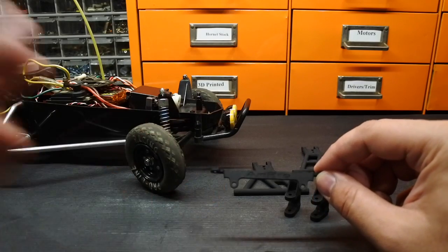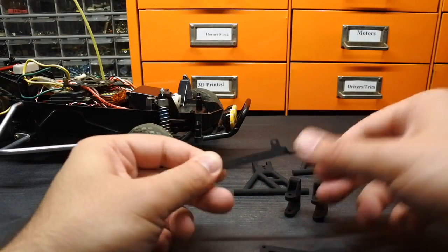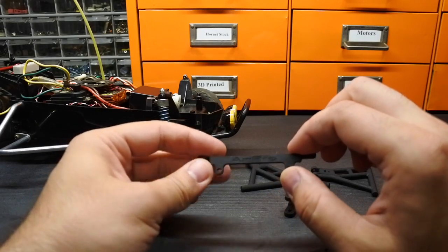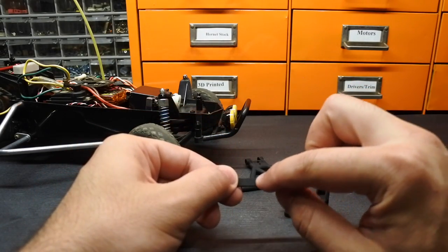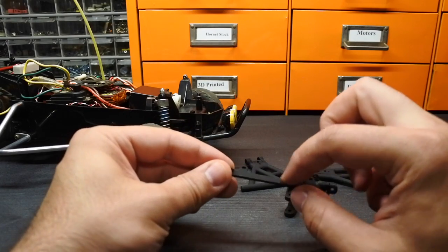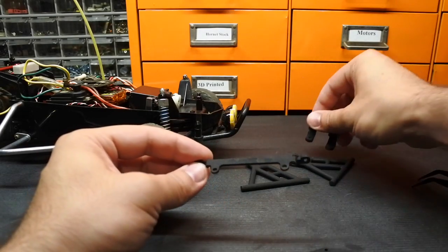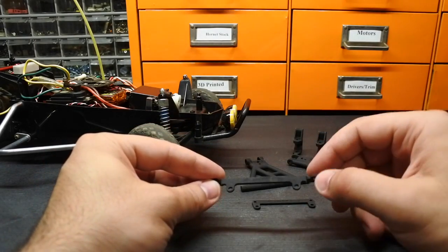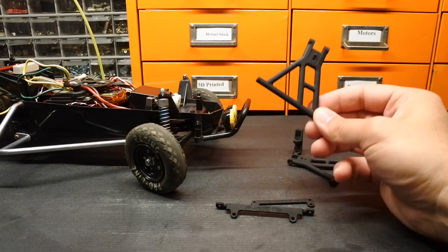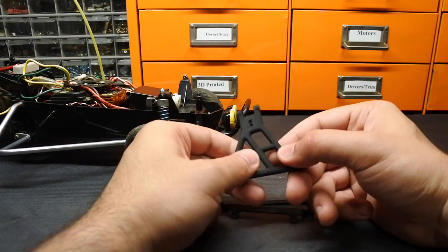They're actually all white — it is a laser-sintered nylon. These are quite durable. I know people tend to think 3D printed parts are made out of butter, but these are in fact very, very durable. They're dyed, so any area that you trim like a sprue is going to have a little white spot of the actual white nylon. I do my best to place the sprue in areas where it's not going to be visible. It's actually a lot cheaper on Shapeways to have a number of plastic components all tied together on a single sprue. If the colors available aren't really to your liking, select the white polished — these take to paint absolutely beautifully. This is about two or three coats of low gloss black; it has a kind of a matte sheen, which I was after.